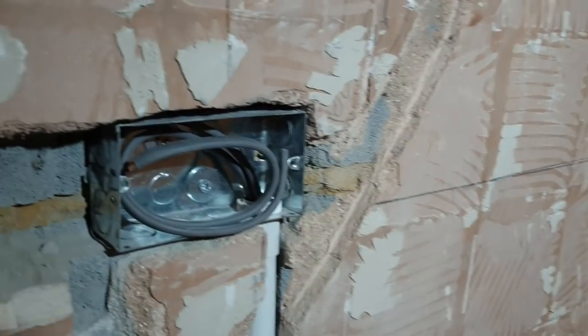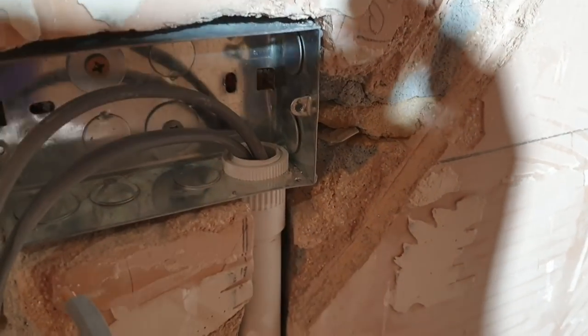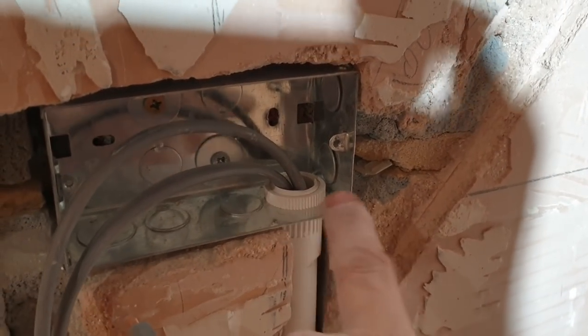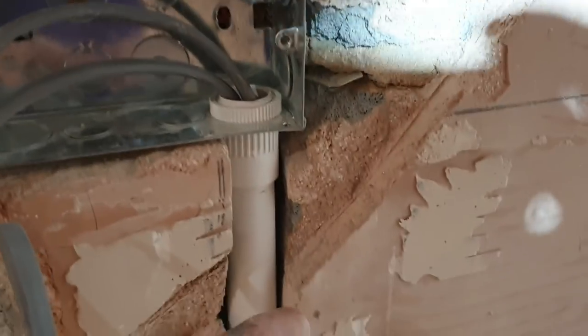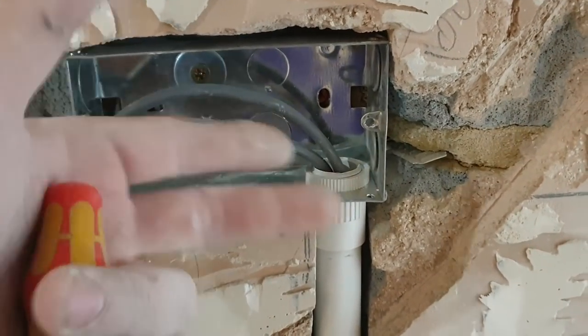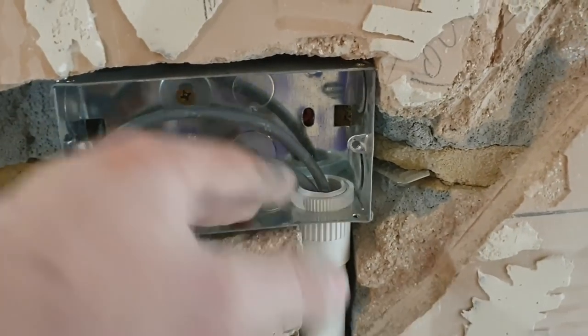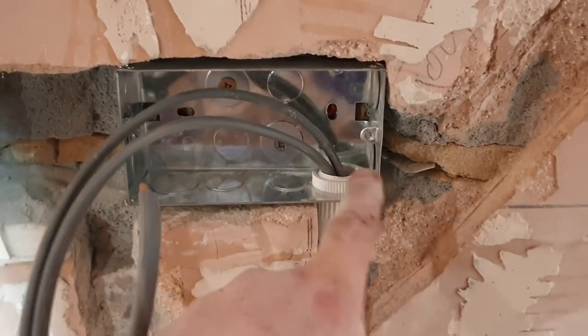So, anyway, just before we leave, I just wanted to talk about this. You see here, I've used some conduit, and I don't normally do that. I normally use oval conduit or capping. I don't normally use standard conduit, and I've actually gone for 25mm, which is slightly bigger. Before you say it, chaps, I know you're supposed to use a female adapter. I asked for female adapters. I opened the bag, and they were full of male adapters. A bit too late now, I'll put them in anyway. Hopefully the sockets still go on. But anyway, I don't normally do that.